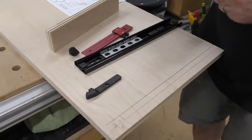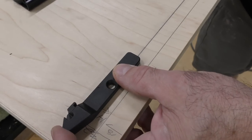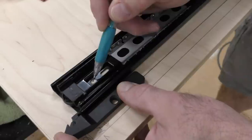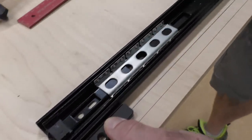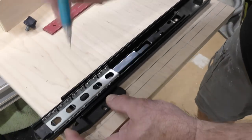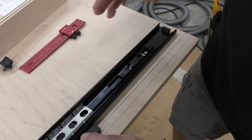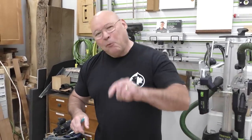We'll put this on the LR32 rail in a minute. The catch will go just like this. The next hole is spaced 32 millimeters for the first hole — we're going to punch that five millimeter hole and then the back one. The back one is spaced 224 millimeters from that first hole at 58 millimeters. I'll show you how to lay all this out and how to punch them.